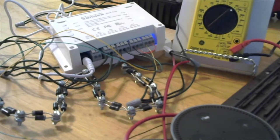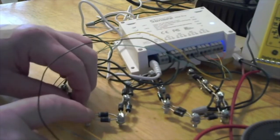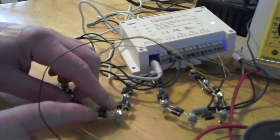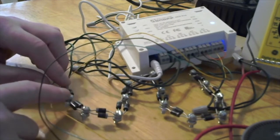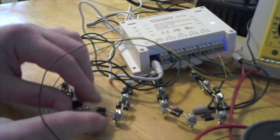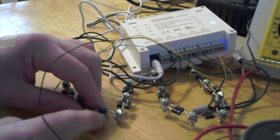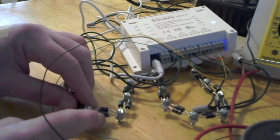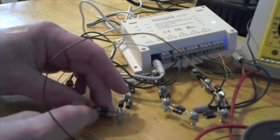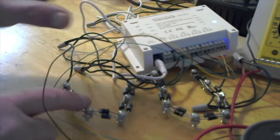And so what's happening is that these diode strings, which are just pairs of diodes back to back, in other words, one diode facing one way, one facing the other, so it's passing AC. Diodes, of course, pass only DC, but back to back this way it'll pass AC, and each diode will reduce voltage by approximately 0.6 of a volt. And so a pair done this way will reduce the AC voltage by approximately 0.6 of a volt. And so I have a string of 13 diodes.